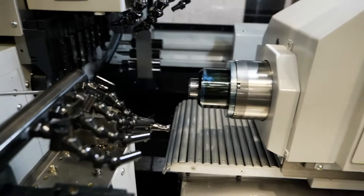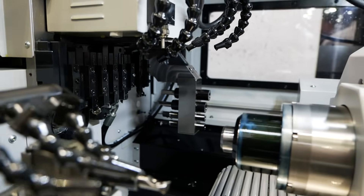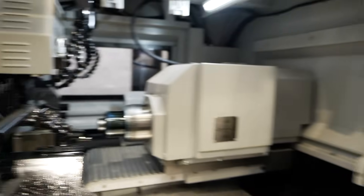Well, actually, the Swiss DT38HP, unlike the Swiss DT42, cannot rough and finish at the same time — but that's not a problem. The Swiss DT38 is an entry-level machine — really the entry door into the world of Tornos. On this base we have a 13mm, 26mm, 32mm, and 38mm machine. What makes it unique from the competition is that the gang tool is fully modular, like you have on the Swiss XT, the Swiss GT, and the Nevo Deco. You can configure the machine according to what you need. If you want to do a medical part on this machine, you can do it — you can grab the tooling from the XT, put it inside the machine, press start, and it will work.